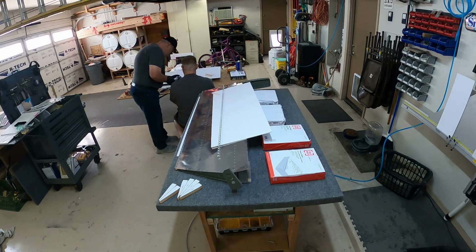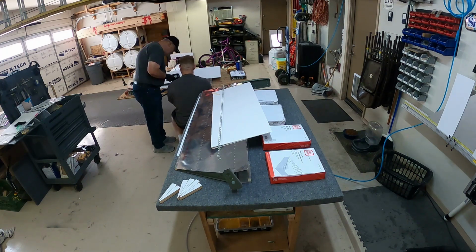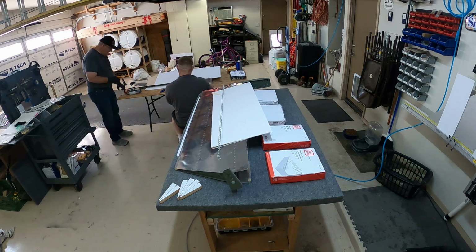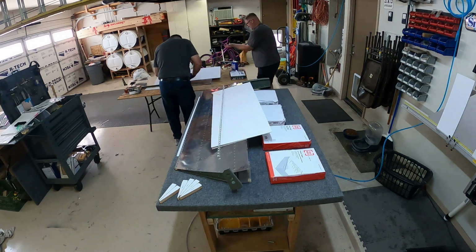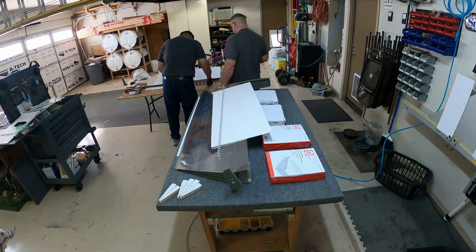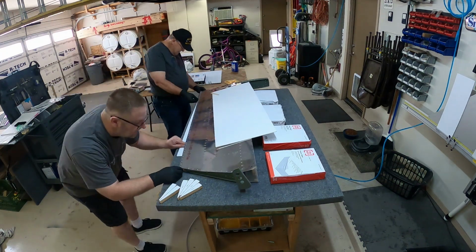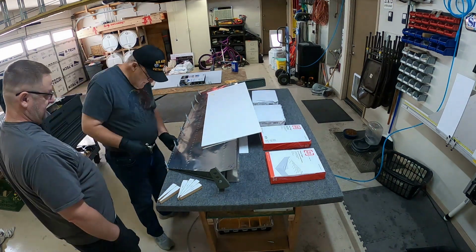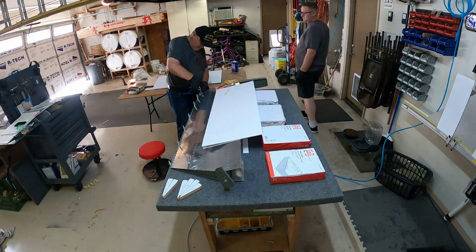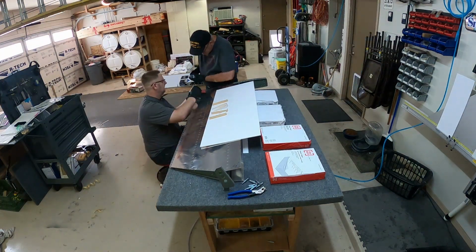I'm working on the left elevator right now, putting in the 2 trailing edge, the little it's not styrofoam, the little, what is it, I don't even know what they're made out of, but it's foam something or other. You put some tank sealant on them and slide them into place where you've scratched the aluminum so they can stick, and then you cleco the trailing edge together and put some weight on it. The first thing you do, though, is you put a piece of double-sided tape to hold the trailing edge wedge. You put that on there, and then undo it, and then